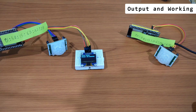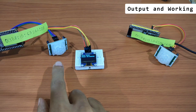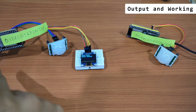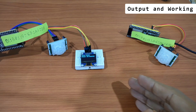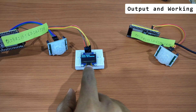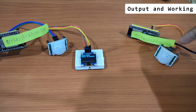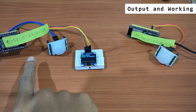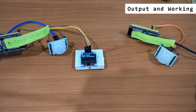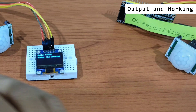I've made an arrangement with my PIR sensor here. As you can see, when the sensor is not facing my body it's not detecting motion, but now since the sensor is facing me it is detecting motion. This is refreshed after every second. This ESP32 reads from the PIR sensor and broadcasts it to the other ESP32, which then displays the output on its screen. I'll give you a closer view — it says 'motion detected' when motion occurs.